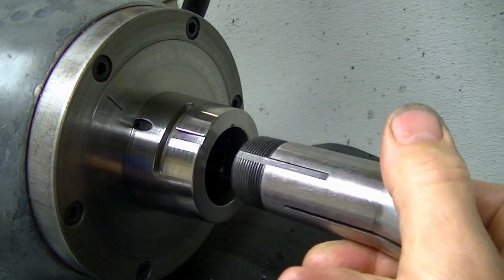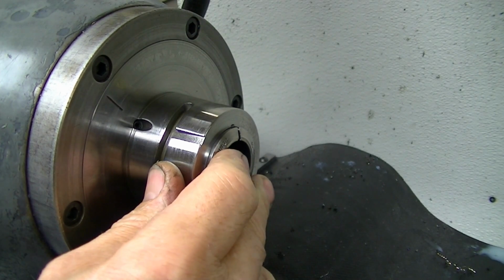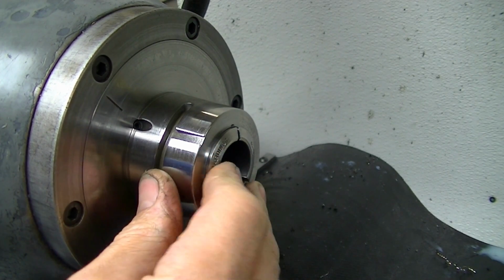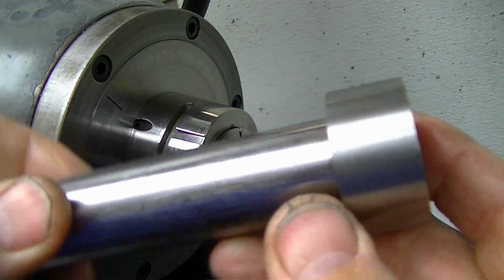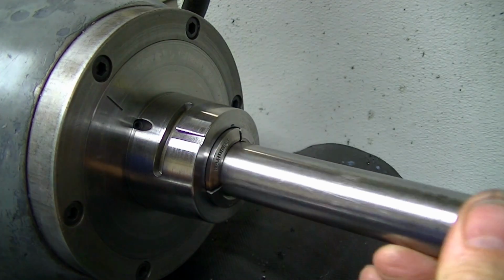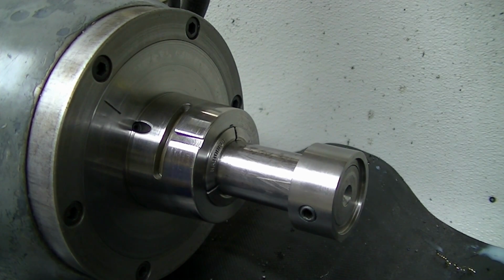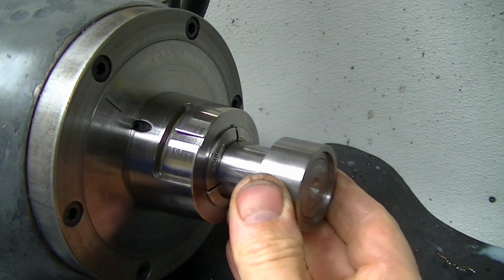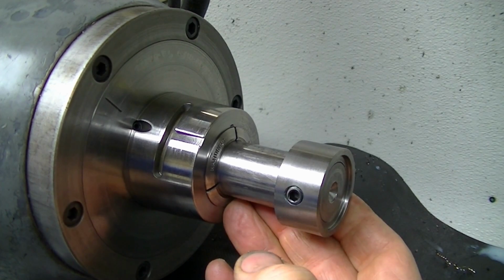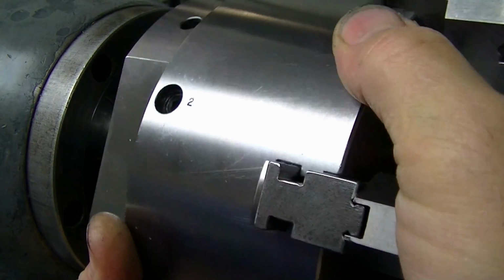Back to our chuck stops. We line up, put in a 1-inch collet, and here's our stop. We put this in and set our collet closing pressure, so that when we put this in, this locks and we have whatever position we want here. Okay, we take this out now that that's adjusted, and we put our chuck on right over top of this.